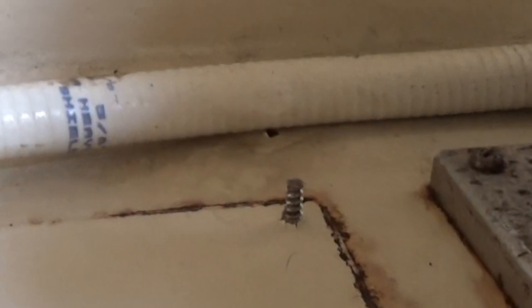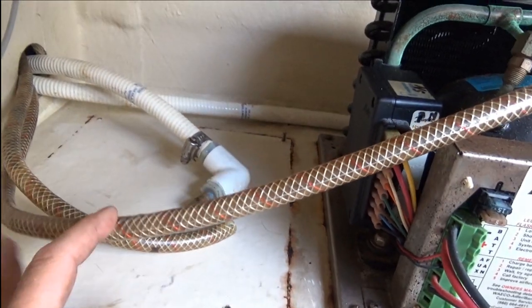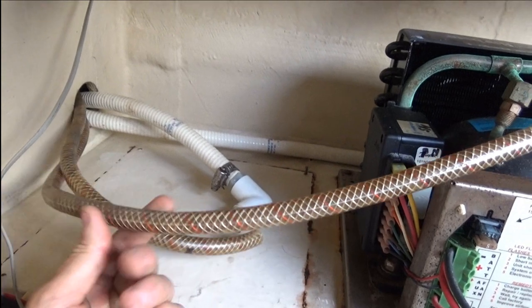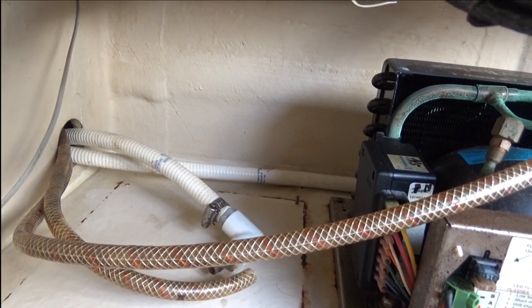One of the things I found is that one of the screws holding the old compressor had the head snapped off, which happens kind of frequently. That's why I take the extra precautions around most of the boat things for the marine environment. If you are tearing something apart like taking out a compressor, go ahead and replace the hose clamps, replace the wire terminations if they look bad, or even the screws. It takes an extra 10 minutes which is frustrating while you're doing it, but it might save you an hour underway at sea. As you can see I have a termination where the head snapped off, so I'm going to replace that. The hoses still look pliable but since I'm here I'm going to go ahead and replace those anyway.